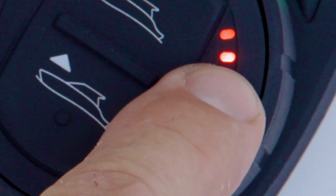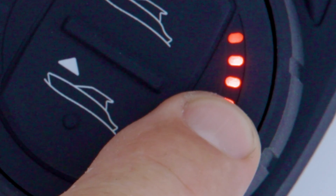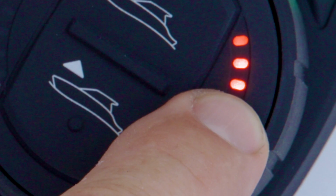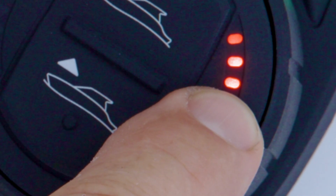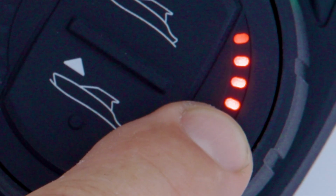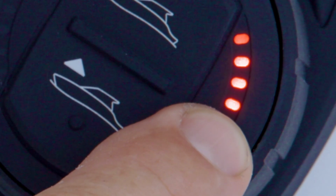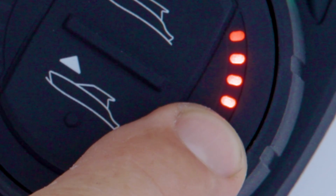The second LED indicates shift position data, and the third LED indicates engine RPM data from the vessel's propulsion source are both available. These data inputs enhance system operation but are not required for automatic functionality. The fourth LED is for Mercury SmartCraft digital throttle and shift applications only and indicates that throttle lever demand data is present. This feature enhances system performance but is not required for operation.